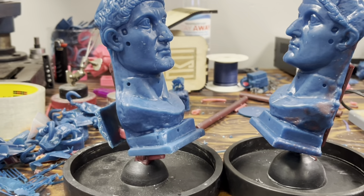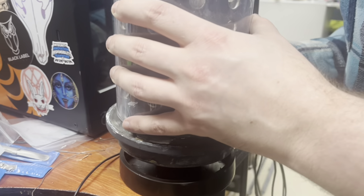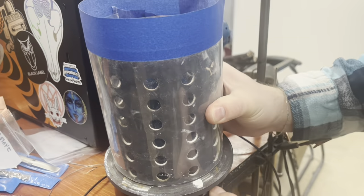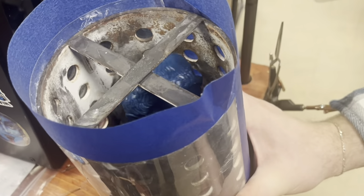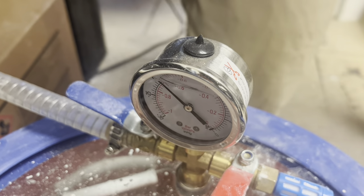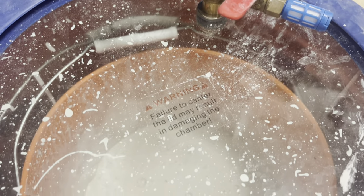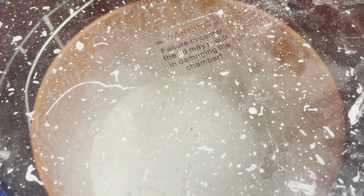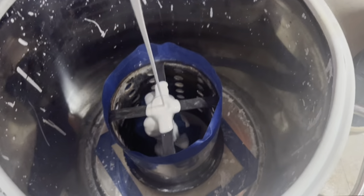Having taken the bottom off, we keep and place the small slab on the back of the sprue to attach later with some welding. A detail you might notice about these 3D prints is the small three to four millimeter holes periodically throughout the bust. This is something we did while slicing the file in Lychee Slicer, which helped with the suction forces of such a large print and as an added bonus, along with the bottom of the sculpture, will help hold the investment core in place.